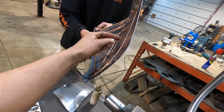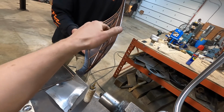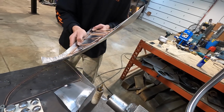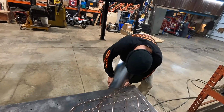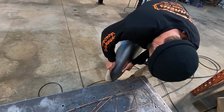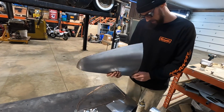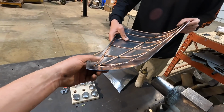I think that maybe you could go back and wheel it a little bit or bend it over your knee to orientate this over. Then your pucker will happen here again and you'll be able to pull a little bit out. Another option other than the English wheel. Couple hits on the old leg.